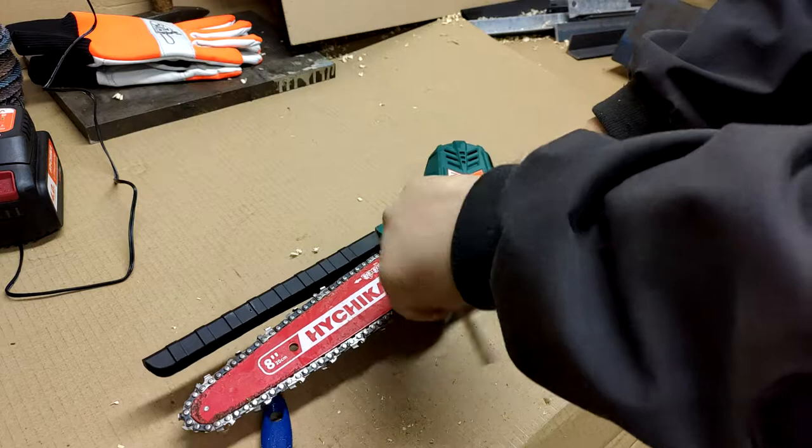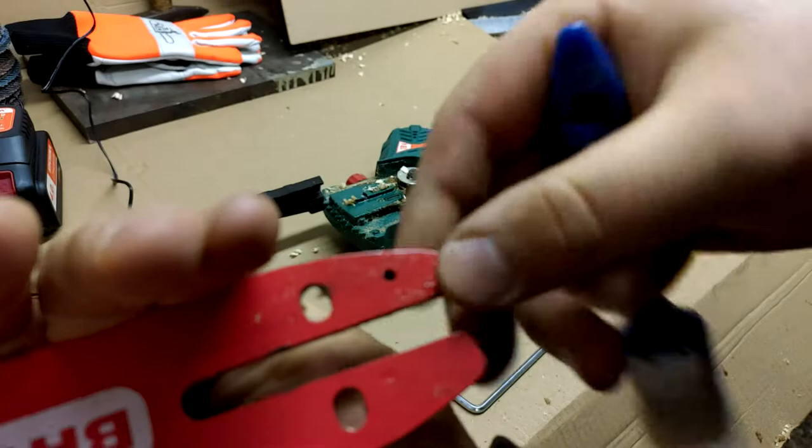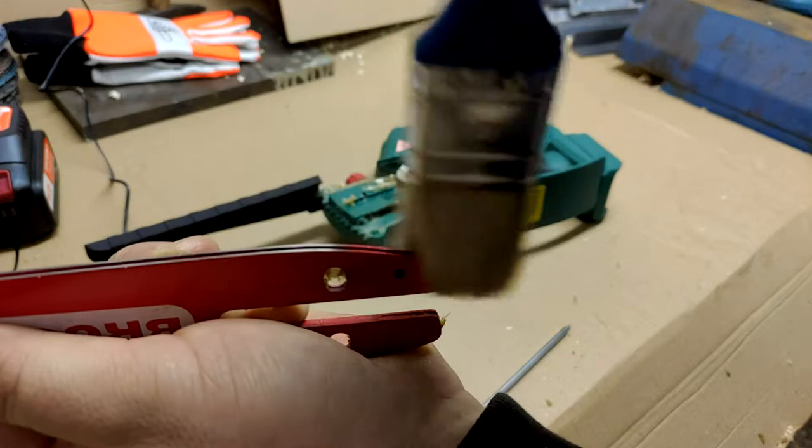Beware, the saw has unusual oiling and it has no need for a gasket in the cover plastic. For lubrication, this chainsaw doesn't use regular holes but these small holes. Always keep the holes and channels clean. You can blow through them, for example.